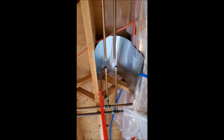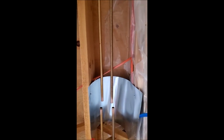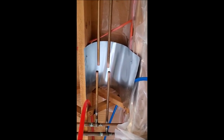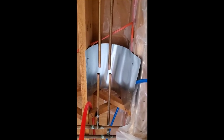Remember how we always talk about safety — safety first, safety for yourself, safety for the building, just plain old work safe. We've got to go home at night. What I've done here is put a sheet metal shield because I'm going to be soldering and that's fire. The flames are going in a vertical position, so the shield will protect the wood from getting too hot and igniting. It only takes a minute, maybe a minute and a half, but it could save a lot.